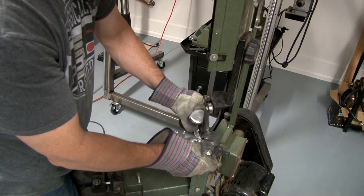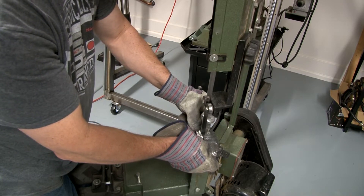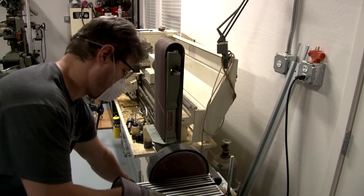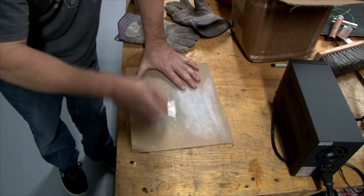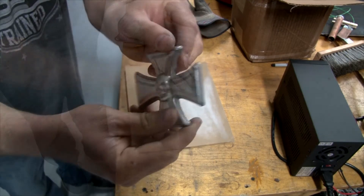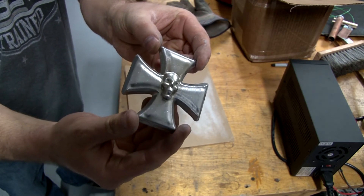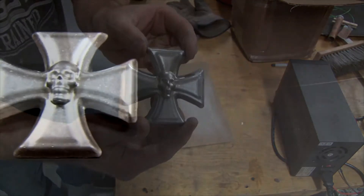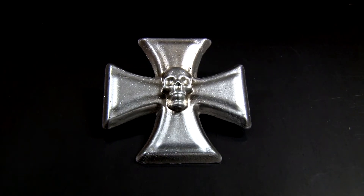Cutting the gates off. I sat down on the bandsaw and my butt shut it off, so I'll just straddle it to cut the gates off. I did a lot of sanding — I'm just putting in a short little video of it. I couldn't get the back of the casting even so I just used sandpaper to make it look even. On the back here you can see a little low spot that I couldn't sand — I just left it. Otherwise I'm pretty happy with the casting. Here's a close up — you can see how shiny and how the surface finish turned out. I did not do anything with that surface: I didn't polish it, wire brush it or anything. That is how it came out of the casting. Totally happy with it.